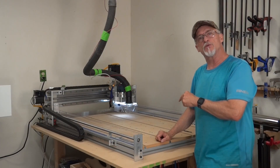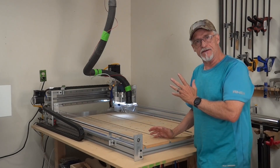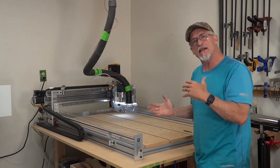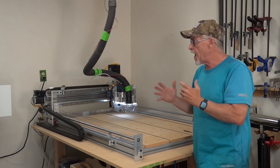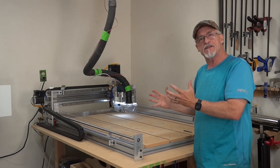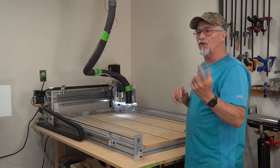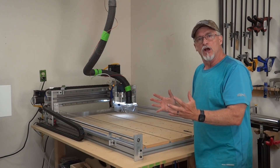The CNC machine was the first thing I purchased, about five years ago. This came as a kit. One of the things I would recommend if you're looking at CNC machines — whether to buy one assembled or as a kit — if you're handy at all, I would highly recommend that you build it. At some point you're going to have to replace some bearings or do some fixes, and if you've put it together, you know how to mechanically take it apart and fix it. You'll thank yourself two years down the road.